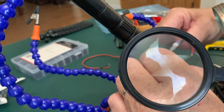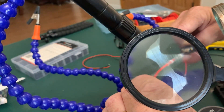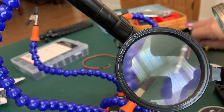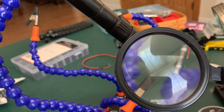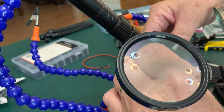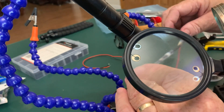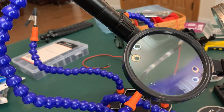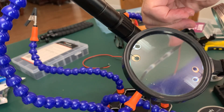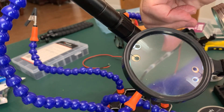Now I'm going to slide the connector in until the conductor is overlapping with the finger wire — it would help to make sure I have the right wire in place because if I go red to blue I'll get these wired backwards. Interestingly, the Vibronix motors are really sensitive to being wired backwards; the Amazon motors don't seem to mind as much. Now I have the heat shrink on the motor, enough conductor exposed, and the conductor overlaps with the stripped conductor of the black wire, connected to the blue on this Vibronix.